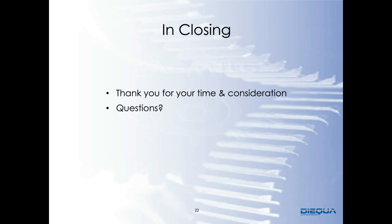Tom, the first I have coming in is, what levels of efficiency can your DB series worm box deliver? So when we look at the performance of the unit, we're typically looking at servo motors that have, let's say, 3,000 RPM as a rough average. So if I take that as a starting point and I'm looking at a motion profile that has stops and starts, and I take a mid-level unit, in a 10-to-1 reducer, I'm at 92% efficient. And that holds pretty true through all 10 sizes of the DB series. As you get up to higher ratio, higher speed, that will fall into the probably 62 to 65% range. Great question, by the way.